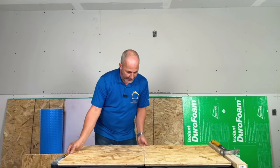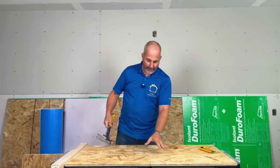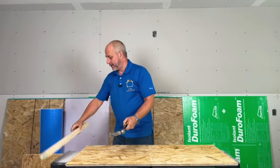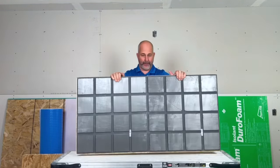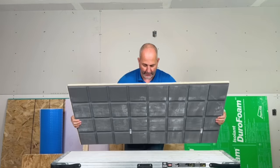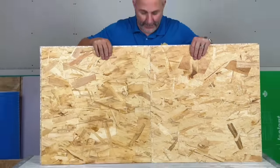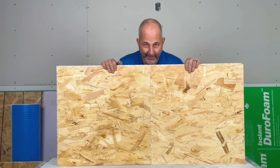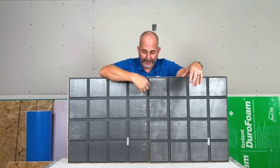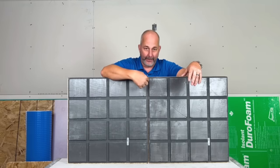The way these systems go together is simple — they're tongue and groove and you have to take a block to hammer them together. If you're really efficient, you can almost eliminate the gap. That gap, if you don't hammer it completely tight, means you don't have a thermal break. Every joint is going to be a place where cold comes up through the floor. In my experience, that's not the way most people install this product — most people install it with gaps.